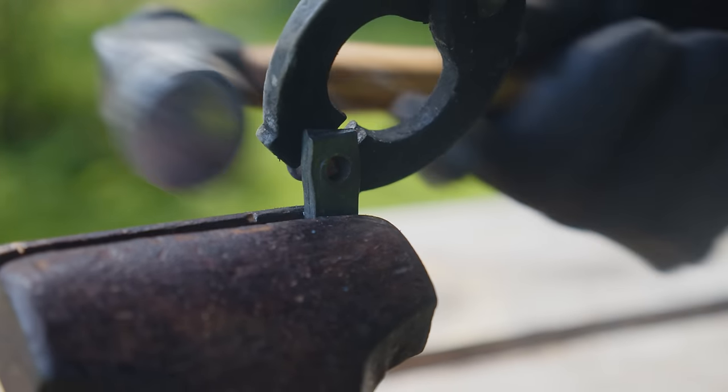The nice thing about these is the consistent measuring. So we can come from the top here, and with that we can make a mark, then move it over, make a mark, make a mark. Now we have consistent marks all the way around the outside radius of that fan. And we can take a straight edge from each mark to the center point and scribe a line. And then you have your layout for your fan. Now it just takes some dimensional carving and you have something that's pretty cool and pretty period correct.